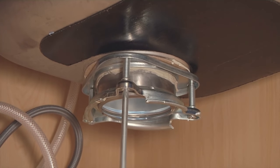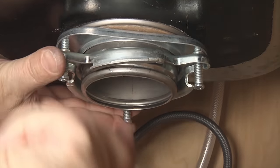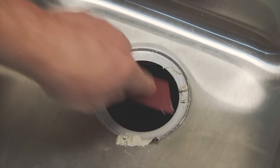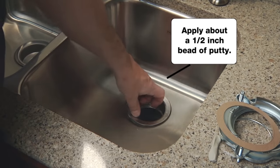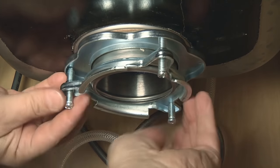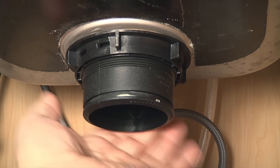If you need to install a new sink flange, loosen the mounting screws of the existing one and pry out the mounting ring. From above, remove the old sink flange and clean any old putty out from the sink. Now apply a bead of plumber's putty to the new sink flange. Place a towel down and use a weight, such as your new disposer, to hold the new flange in place while you install the new mounting ring from below. For easy-mount disposers, simply screw the new mounting flange into place.